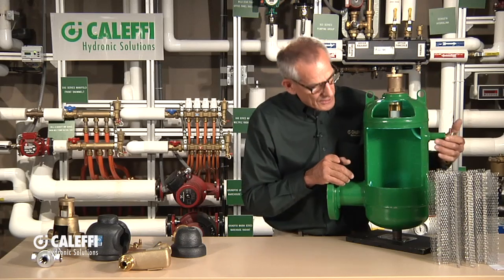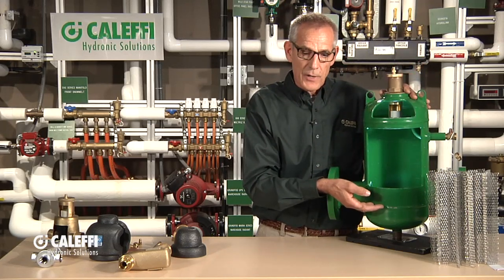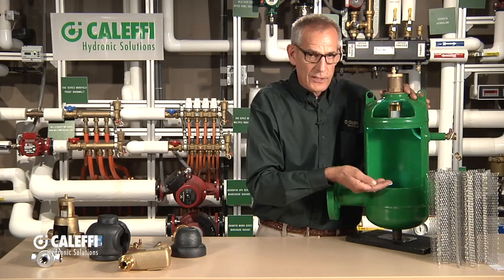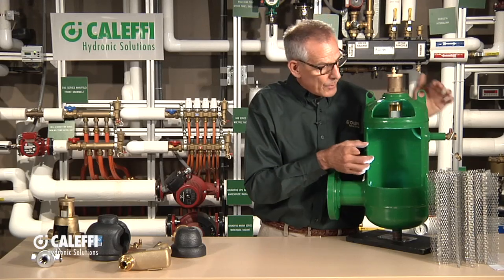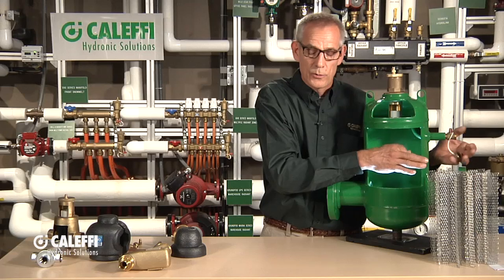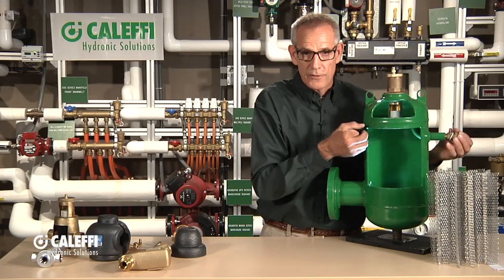Inside here you'll see a little valve on the outside and a gooseneck tube that goes inside there, bending in. Think about this — when you first fill up a system, all the debris that's in there, especially if you're using threaded pipe, soldered, or roll-grooved, that debris is going to float up as you fill it up the first time. By having this full-port ball valve over there, as fluid comes up, that debris floats up with it, and we're going to be able to flush it out the side of this tube — maybe with a garden hose or washing machine hose connected on that. So we can get that dirt and debris flushed out before it has the chance to get up into our float and air vent mechanism.